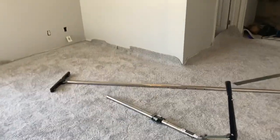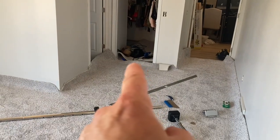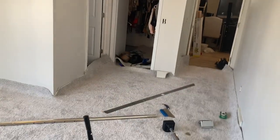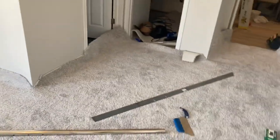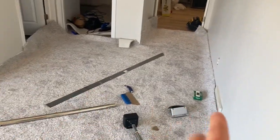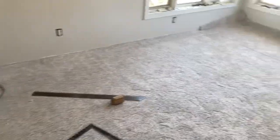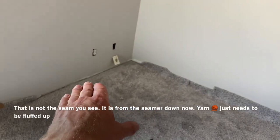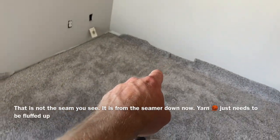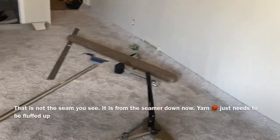Do some stretching. So this is kind of a funky little layout. We're actually gonna stretch to that seam. I'll show you how I do that after a bit. But we're just gonna treat this as 2 rooms. We're gonna treat this area separate, and then from here over to here in this whole area, we're gonna treat this separate too. So what I've chosen to do is I set that wall. Here's the seam starts there and runs along there, but I want to stretch across my seam to this wall.